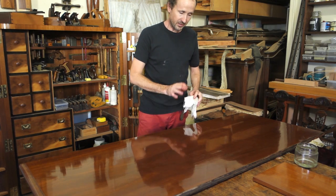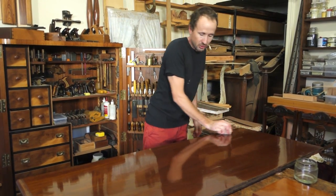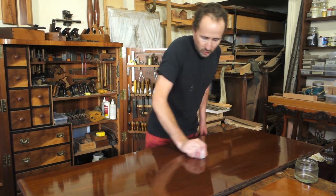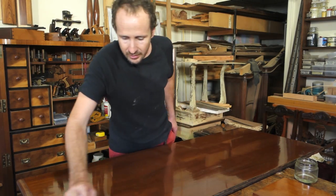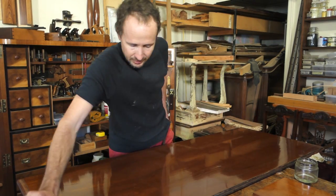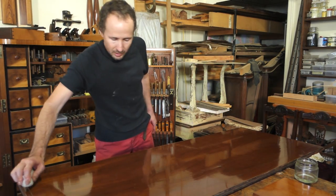This is the stage where you can actually see how you're going and whether there are any circles left. Sometimes you have to spend quite a while — it might be a good half hour of just straight strokes, straight up and down. I usually find if you start with quite a bit of pressure stretching out that finish, as you go you can decrease the amount of pressure, till right at the end you're using the rubber with a reasonable amount of metho in it and very little pressure — just light passes. At the moment because I'm applying a lot of pressure I don't have too much metho in here, as it'd start oozing out around the edges. But for the final, really final passes that are a lot lighter, I have the rubber loaded up quite heavily.